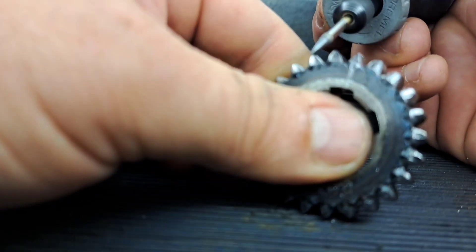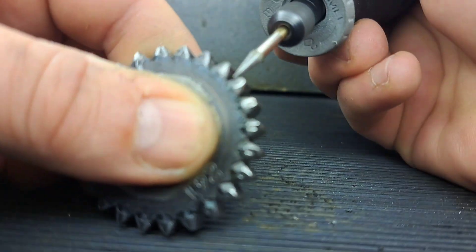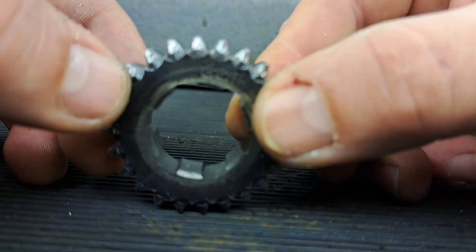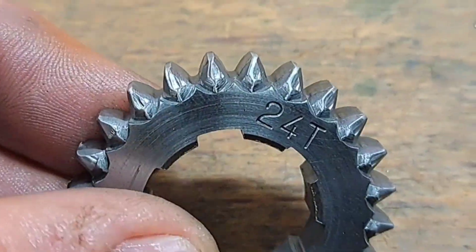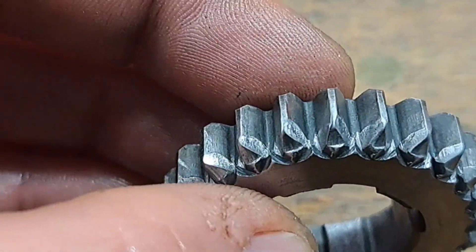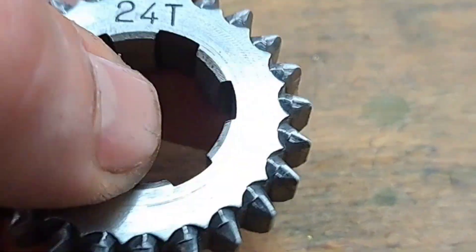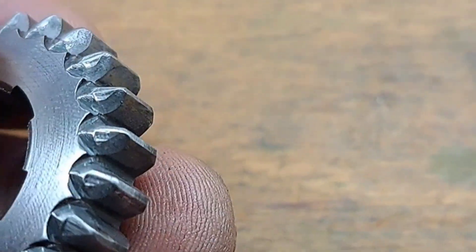There are a lot of burrs that are throwing themselves into the gears, and that's not allowing the gear to pass through the other meshing gears — so this is why I was fixing this problem. Hopefully you can see the work that's gone into each individual gear tooth. I've had to angle each gear wheel and take off every single burr from every single gear tooth. I think so far so good.